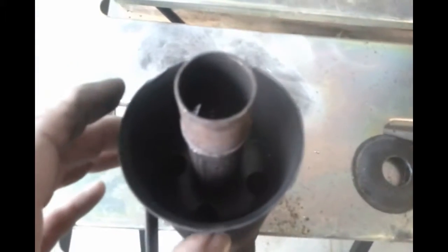I suppose I could put it down in there, use a stick welder to just tack it to that, then pack it all - plug these holes first, stick that down in there, tack it into place, put the packing in, then put the end cap on and weld it in. Hopefully I don't burn the packing all up welding it in.